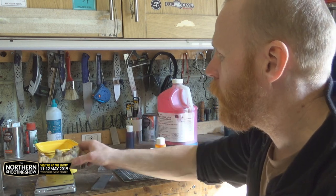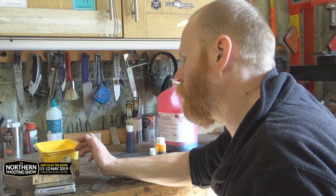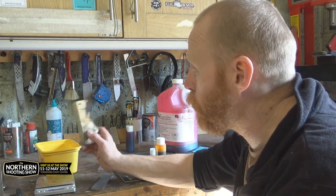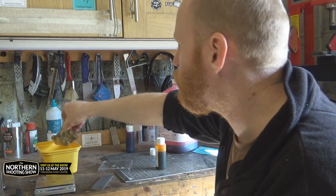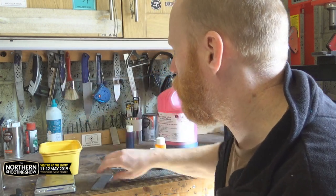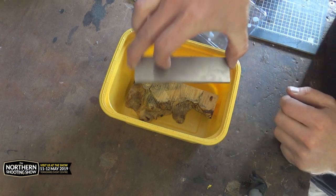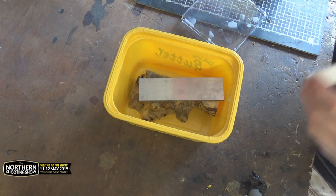The resin that you put into it can start clouding it up if you wanted a clear one. So what I'm going to do first is weigh it — that's 61.3 grams. Once I've soaked it, put it in the vacuum chamber, got the resin to go into it and baked it, I'll re-weigh it and we'll see how much resin it's taken on. First job, put it into a tub — just a plastic tub — and then put the weight on top of it to stop it from floating, then add the cactus juice to it for it to start soaking in.